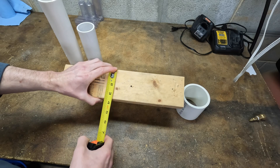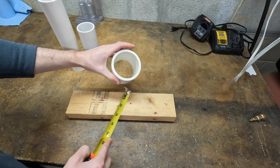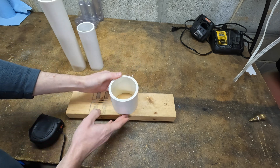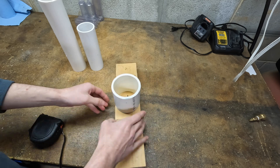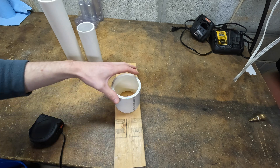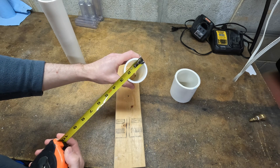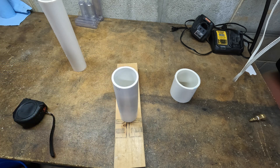Based on the research I did, most radon systems use 3-inch or 4-inch pipe. The challenge of running through an interior wall is that walls are framed from 2x4 lumber, which means the inside cavity of your wall is 3-1/2 inches wide, usually a hair less. The outside diameter of 3-inch PVC is 3-1/2 inches, so you can't run 3-inch PVC through a 2x4 wall without being perfectly centered and probably shaving down the inside of the sheetrock. However, the outside of 2-inch PVC pipe is 2-3/8 inches so it can run through a wall, but it creates more restriction, reduces fan performance, and increases air speed which would make more noise.